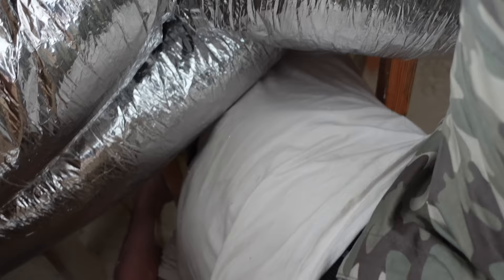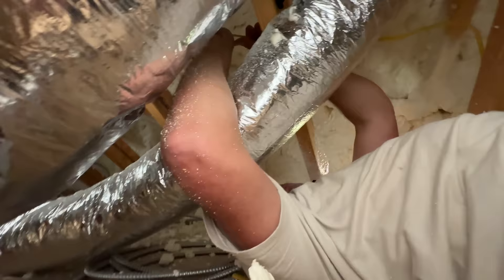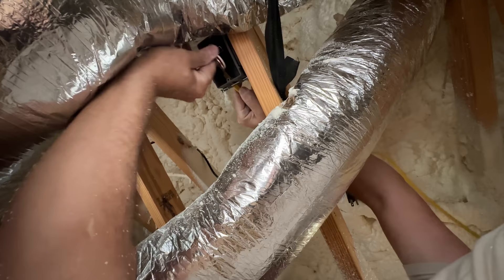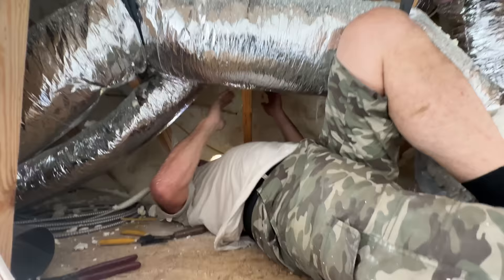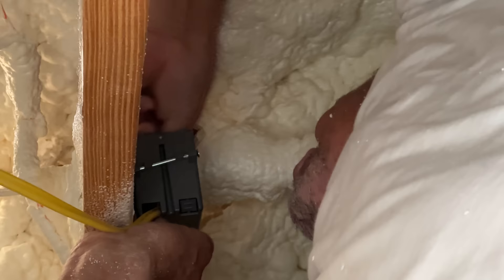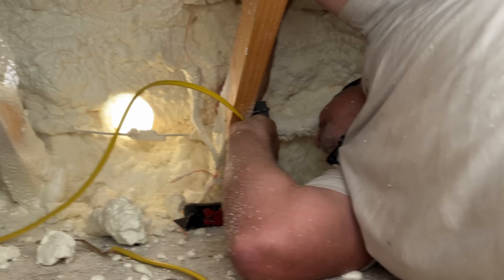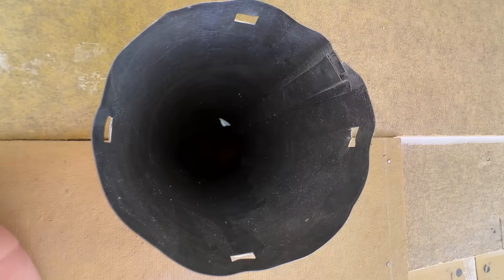Everybody wondering — this is the ERV cord and it won't reach, so we're going to have to put a junction box over here. In other words, I can't just put a receptacle on this new box — it's just going to be a junction box. Let's change this wire to that junction box. I've got a staple right there — and another one. Of course there are two staples — one's just not enough. I need my diagonal cutters.